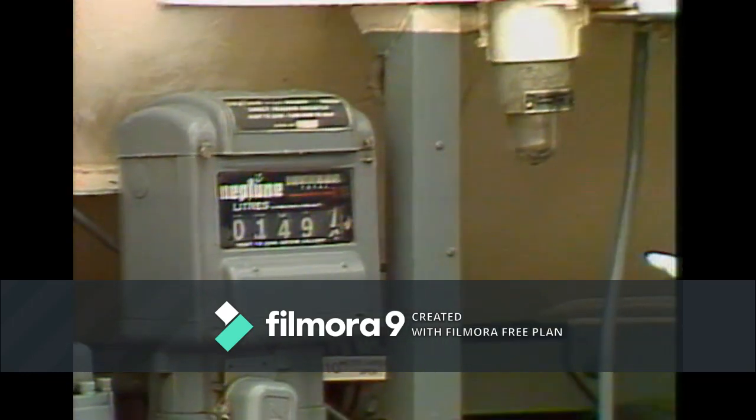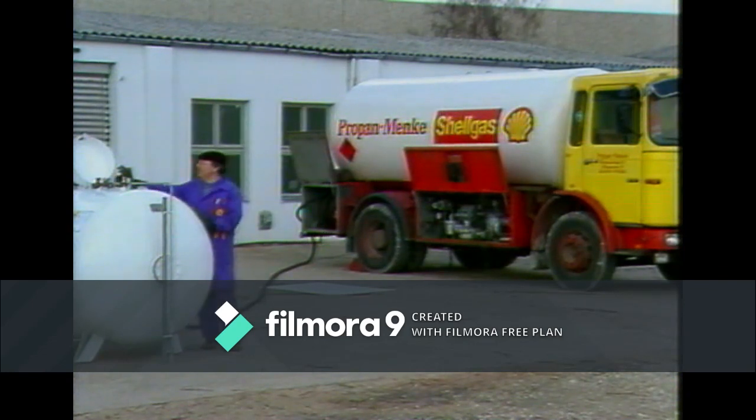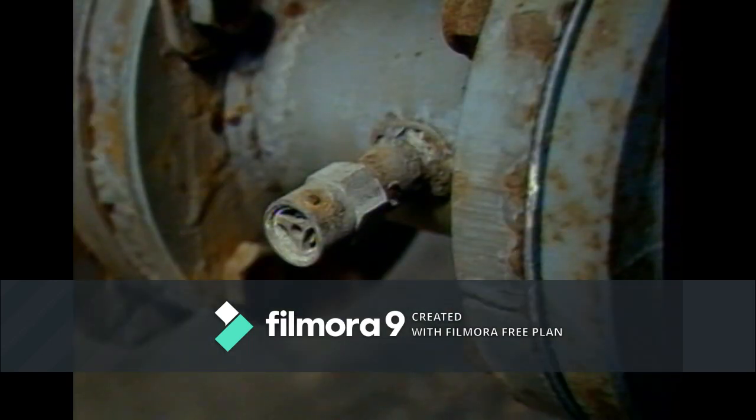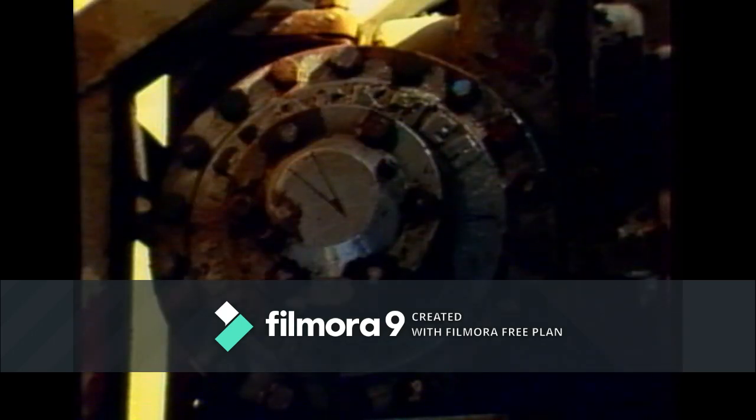For consumer deliveries, some vehicles are equipped with a meter. Some vehicles have a hose unit of the self-winding type. These may be located at the back or side of the vehicle. All pipework which carries liquid is fitted with hydrostatic pressure relief valves. They are situated between valves and allow vapor to escape when the temperature rises and excess pressures build up. The pump is used for self-loading and discharge of cargo. It is mounted beneath the tank and has a bypass leading back to the liquid space in the tank.